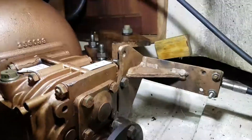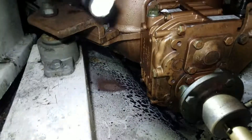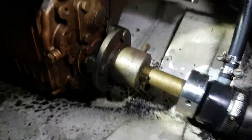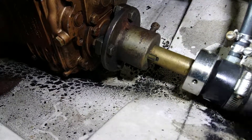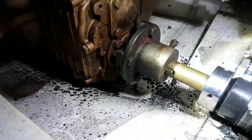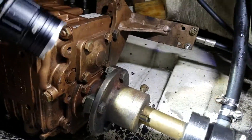They're pretty well maintenance-free. But what you do not want to do is get any oil on this — do not lubricate any of this with oil. If you're going to work on this, move it, or adjust it, use soap — liquid dish detergent. Inside of that silver rotor, there are two grooves that run around where the shaft goes through, and there are two O-rings in there. That seals the rotor to the shaft — it's a tight fit. That keeps the seawater from coming in between the rotor and the shaft. Then the polished surface of that silver rotor to the carbon piece where the hose goes in is what keeps the seawater out and allows it to rotate.